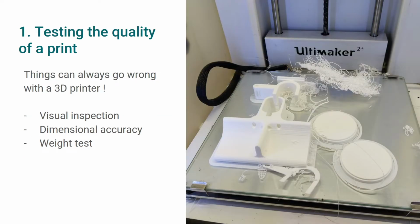As we said before, the quality of 3D printed parts can always vary. This is a downside of the 3D printing process itself. On many occasions, the 3D printer may not be working or extruding the material as expected. A successful print also depends on several aspects, such as the room temperature, the state of the 3D printing filament, and the printing settings. Because of all this, it is important to test the part to confirm the printing process was successful and our 3D printer is working correctly.